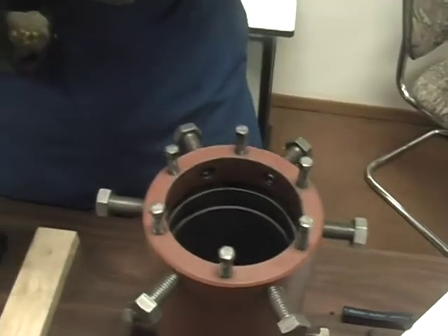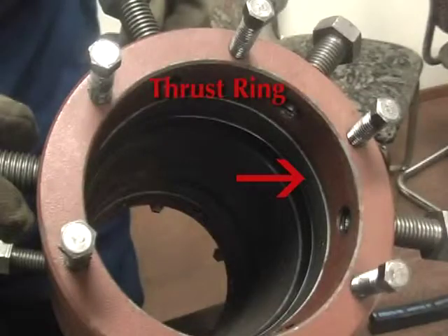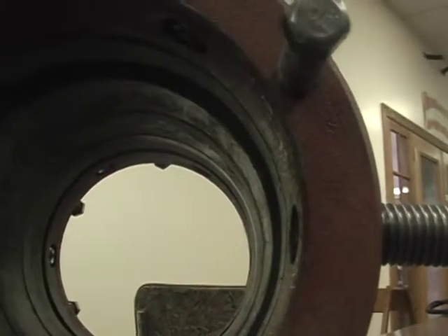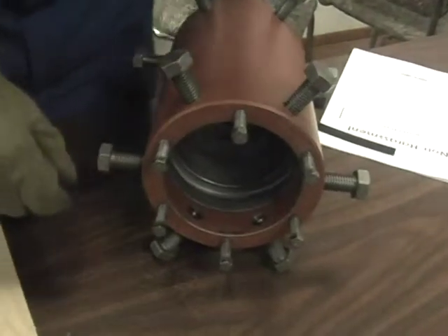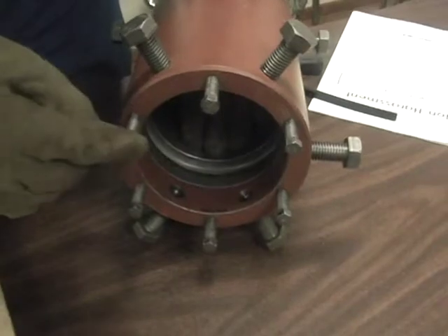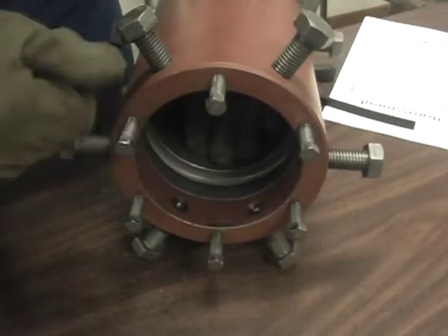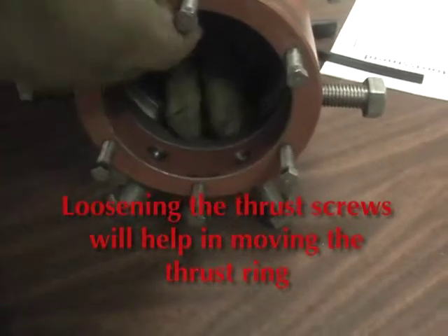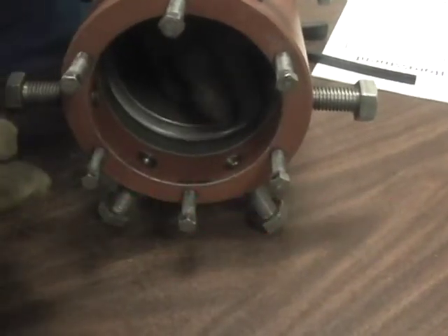To place the ring in the weld-in, you need to move the thrust ring all the way back. This thrust ring slides back and forth in its groove. Before replacing the new ring, ensure that the thrust screws are backed off sufficiently so the thrust ring can be seated all the way to the back of its groove.